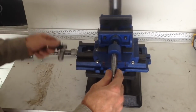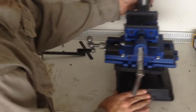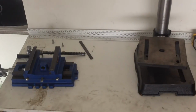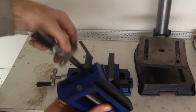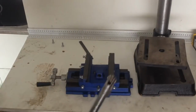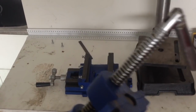so I've got access to all the knobs and screws, and it's going to take up less room and I can mount it square. So what I have to do is a couple of little minor things to the top sliding part of it. I have to notch this little bit out here just a tiny bit because it fouls on the boss for the thread to wind the axis screw in and out. And also because we're going to be switching this guy around, the bearing plate from this side to this side, it hasn't been milled flat, okay, so I'm just going to flatten this, and then we need to drill 2 holes and tap them for the mounting screws, and then that's basically it.